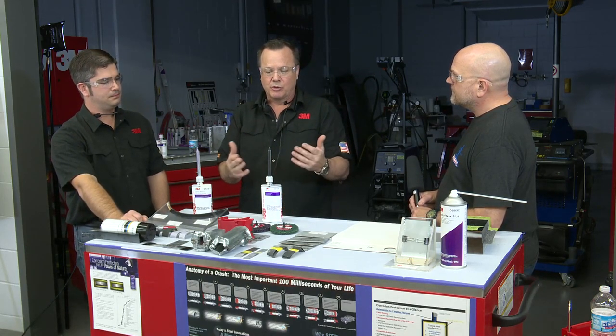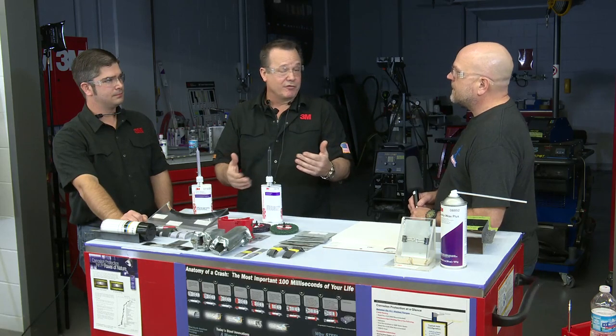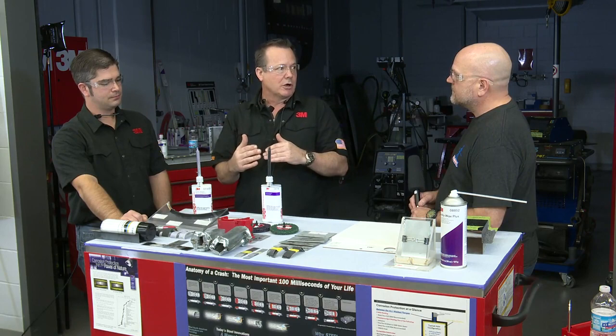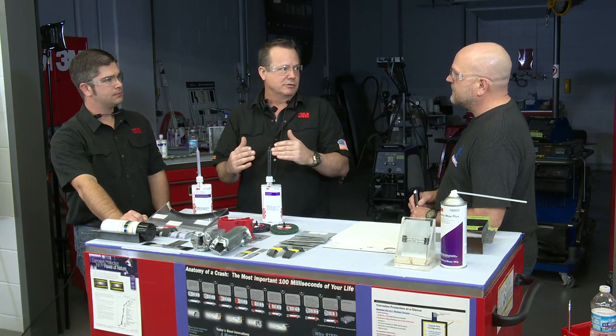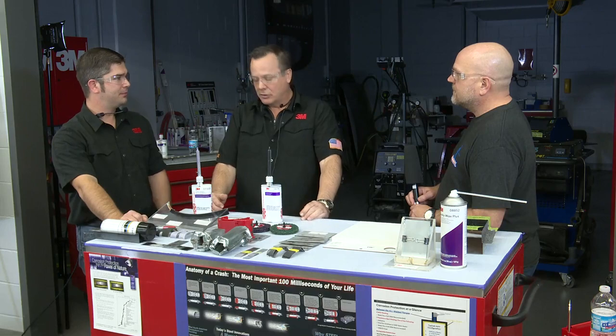But think about it, your work time's gonna double. So you're using an adhesive for 90 minutes. Now you've got a lot of time if you double. So I wouldn't go any colder than like 50 degrees, right? So going from 70 to 50. You don't wanna go anywhere down below 50, but even going to 50 will double your work time. It also doubles your clamp time as well.